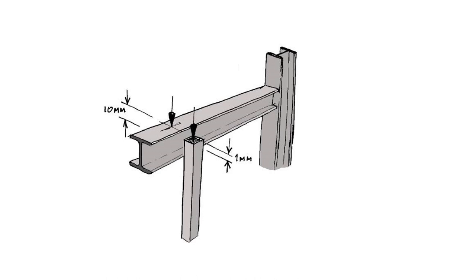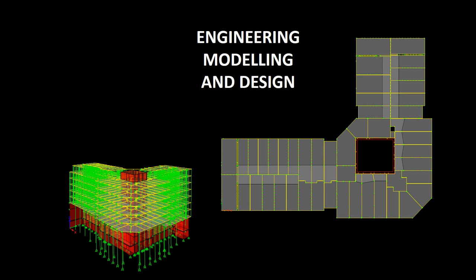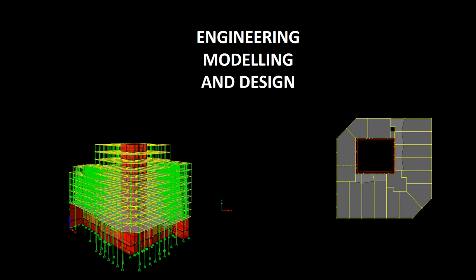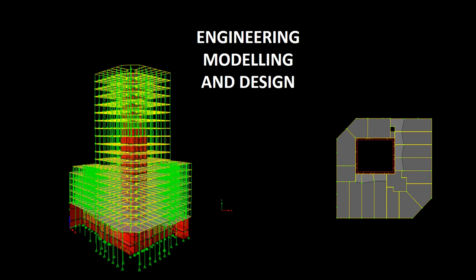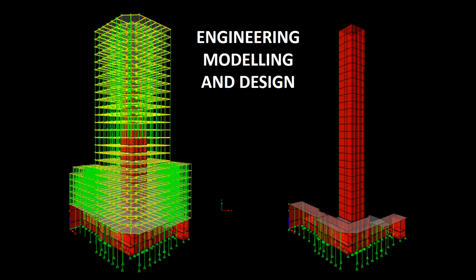These issues are further complicated by the addition of live loads throughout the life of the building. The connections are in place and may affect the load transfer for the occupation portion of the loading. Staged construction analysis is helpful in understanding the consequences of the timing of the various connections and loadings. With non-linear analysis of the staged construction, each module with deflection and connections may be considered before the next set of modules and connections are made, and incremental forces may be looked at at various areas of the building.